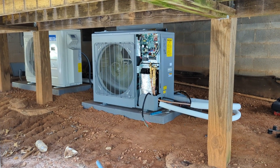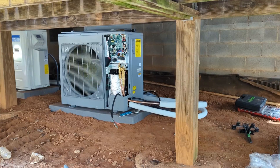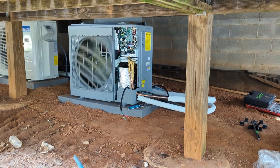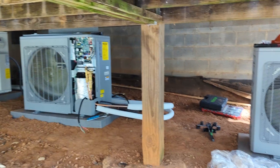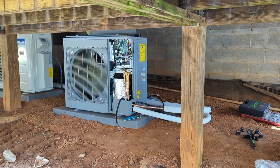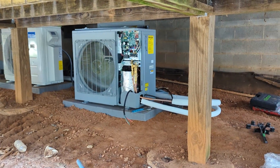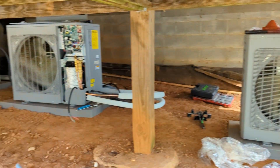Everything is soft-start, so we're making sure we have enough power. We're running SER cable from my panel to a sub-panel out back so I can have electricity for all three units. Tony is hooking up the line sets to the first unit — we want to get that one fired up today. These are DIY units with the piston built in, and they're 50-foot pre-charged line sets. We're going to hide the extra line set up in the crawl space. Since my breaker panel is within line of sight, I don't need to pull disconnects — the breakers will be my point of disconnect.